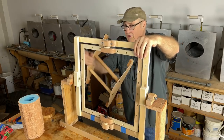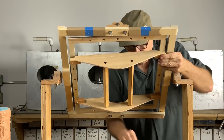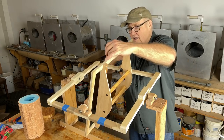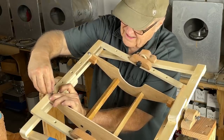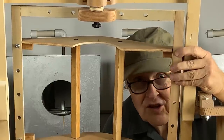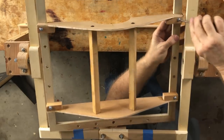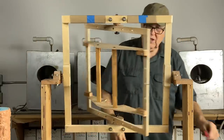The machine, as you can see, is all full of holes, especially on the inner ring, which is what everything mounts to. The whole thing is held on by four bolts, that's all it takes. Here's a tip: what I like to do is have the holes really oversized. If all the holes are really tight to the hardware, it makes assembling stuff a lot harder. This is not precision machinery building, and the good news is it doesn't have to be. Tighten up the little bolts — I'm not going much more than finger tight. It spins like a champion!